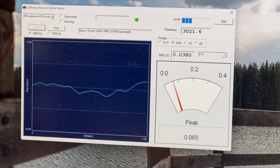And I should mention that too. Almost every single board on this deck has had this stuff glued to the back. And yeah, like I said, this glue goes conductive and corrosive, so it's best to deal with this. And I've had to deal with it on almost every board in this deck so far.